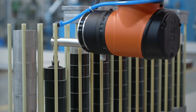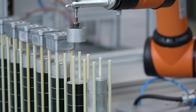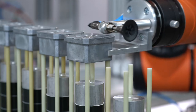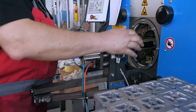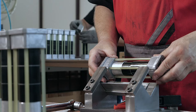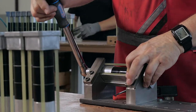The cores of the DH Class Surge Arrestors are assembled according to the continuous operating voltage and creepage distance specified by the buyer. Using a crimping machine, we crimp the epoxy rods onto the top and bottom fitting, and tighten the varistors and housing to the prescribed force using a certified torque wrench. The screws used in the Surge Arrestors are made of grade A4 stainless steel.